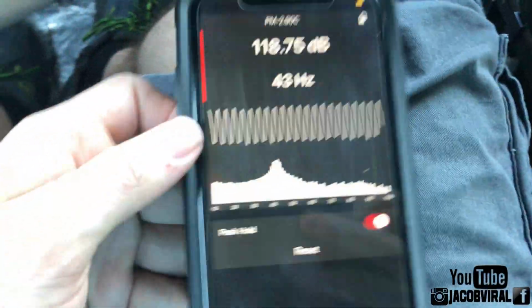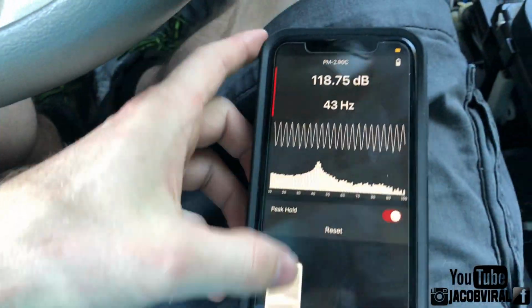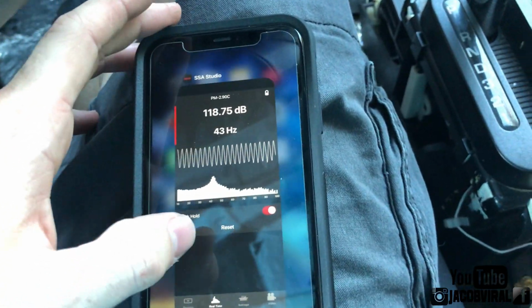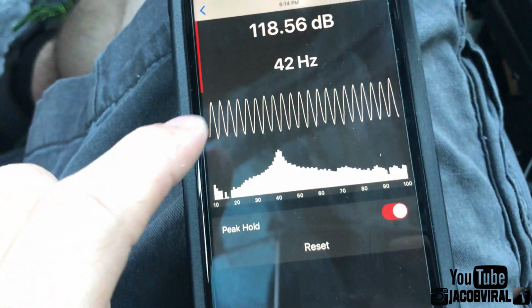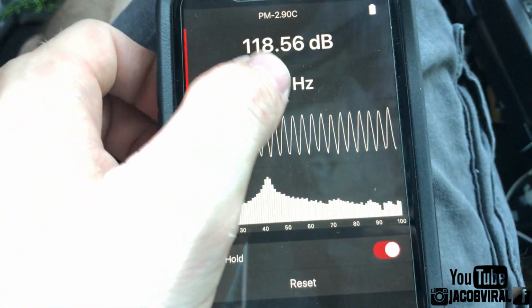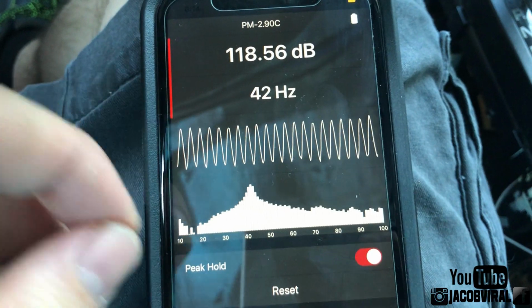All right, so my peak went up one frequency. Before it was 42, now it's 43, so that does make sense. As you open your port up, you actually gain frequency ranges. So your frequency range will depend on how your response is of your port area. As you open your port up, it's bigger, it makes it a wider peak range because your tuning goes up.